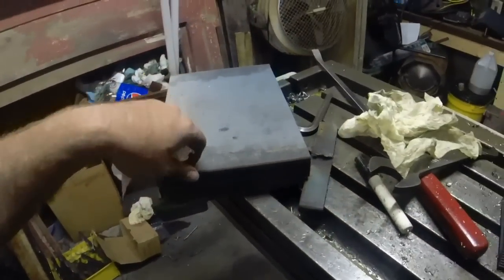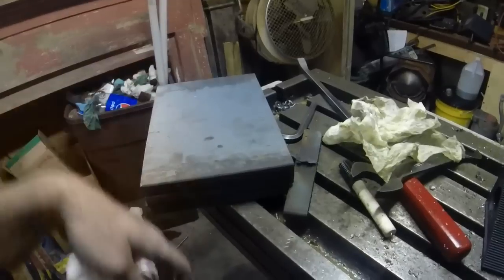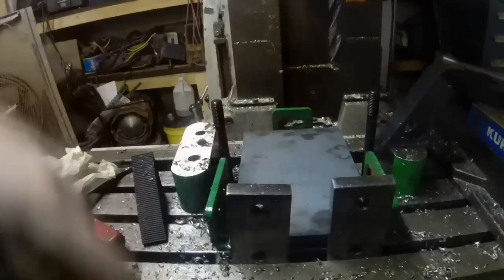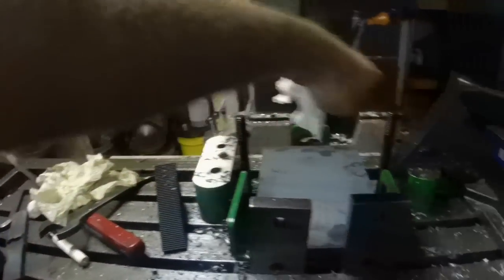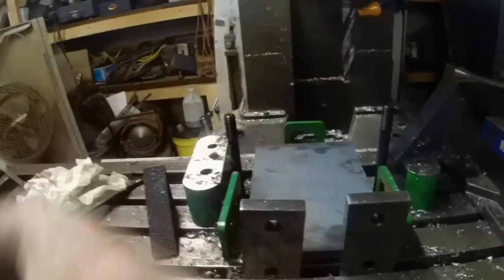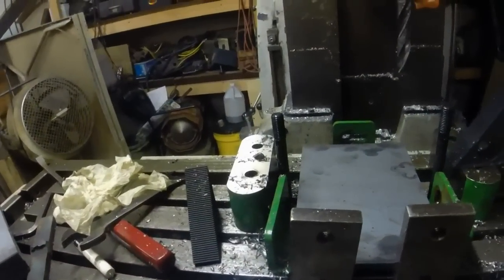In this case I'm actually using them to stack up blocks to drill - these are crane components that repeat over and over again. By doing it this way I can load them in, get them all squared, drill my holes, and pull them out. I can clamp them down so there's no problem about anything moving, because your stack just keeps clamping together one on another, and you don't have a problem with them walking out. That's how I oftentimes do multiple components.